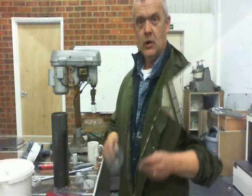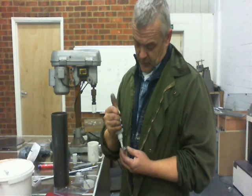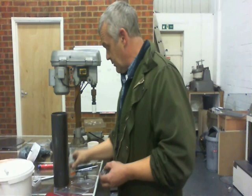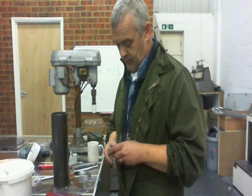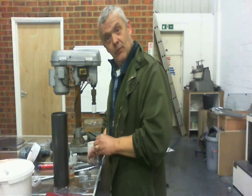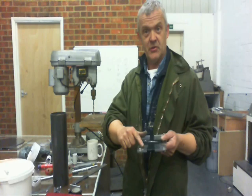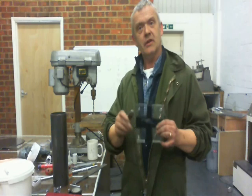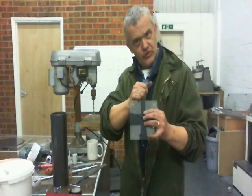With one large and one small disc, I glue them together and drill them out for the 22mm bearing. I clean them up on the lathe, but you could use a drill and trim with a knife blade. Use a six-millimeter bolt through the center to line them up when gluing so everything stays in registration. The base plates are about 97mm wide; I made them 130mm and marked centers by drawing diagonal lines, drilling eight-millimeter holes 15mm in. I taped the two plates together to drill through both at once and keep the holes in registration. Remember to put a saw-mark notch on the edge so you know how to orient the plates when you reassemble.